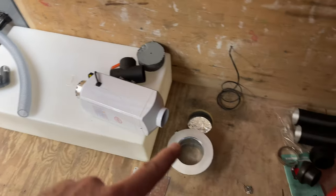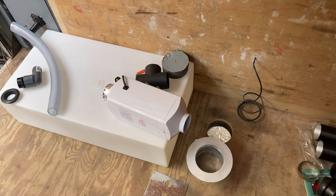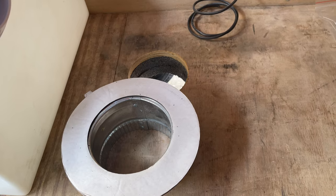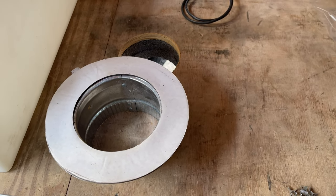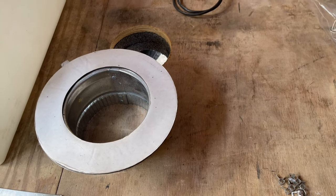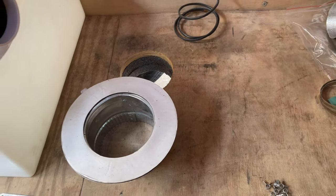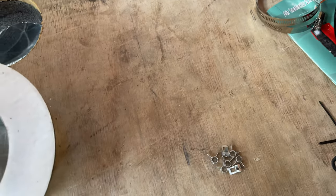I'm in the process of putting in this diesel heater. I've got my tank in here just to get the spacing right, and I cut a five-inch hole. I'm not an expert on these, but there's one YouTuber who does a lot of testing — I'll link that in the description. A lot of people are not cutting this five-inch hole, just putting holes for the pipes, and it gets way too hot — you'll end up catching fire, and this is right underneath your bed. The insulation, the wood — it's all very flammable.